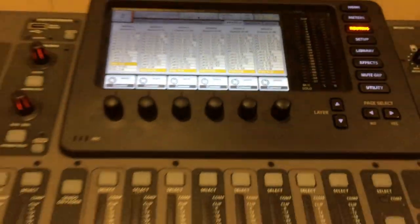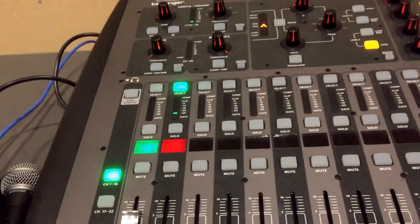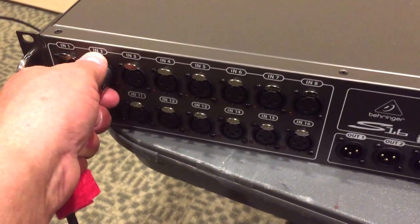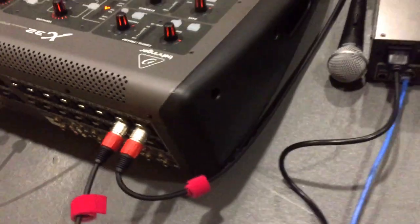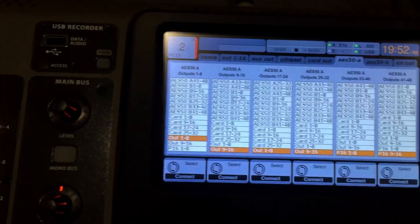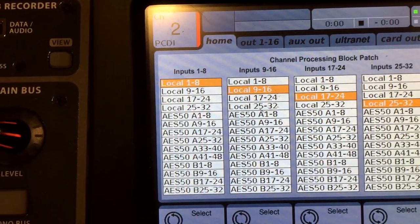So in theory, when I bring the music up — there you go. Let's pull it out and plug it to channel 2, which is the channel I'm running the music into, at the back of the console. It shouldn't work anymore from the console back. Now I can reverse the sequence — going over to the home in routing, go up to local, spin this knob up to local, and press. Now the IOs in the back of the console are hot again.